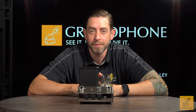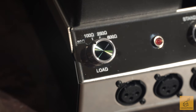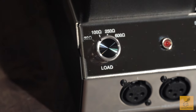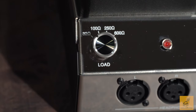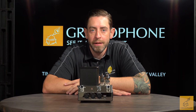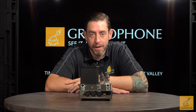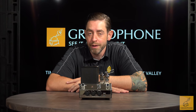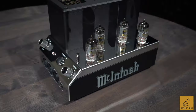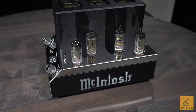This device also comes with four selectable impedance ranges for your headphones: 32 to 100, 100 to 250, 250 to 600, and 600 to 1000 ohms — all at 500 milliwatts. That's a fantastic offering from McIntosh. It gives you the versatility to use a wide range of headphones; with a lot of tube amplifiers from other manufacturers you are very limited, but this gives you the full range to use all headphones available.